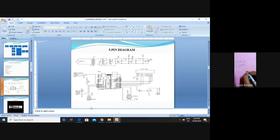And in positive half cycle, D1. Show me the D1 from your figure. Which diode is D1 in your case? D1, D2, D3, D4, sir. Okay, show me the path. In forward biasing, sir, in AC supply, this is like this, sir. This is my DC diagram, sir. And in forward direction, D2 and D4 are in forward direction, sir. Show me how it is. Show me the current flow.